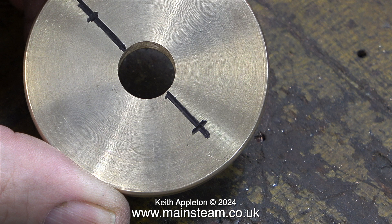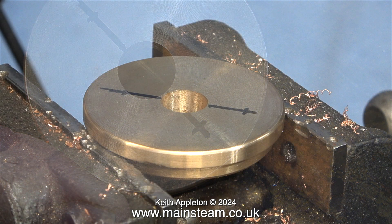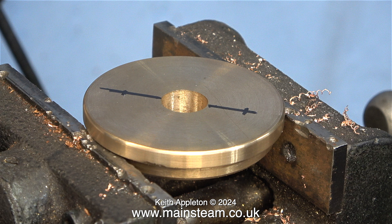I wiped it off and started again but it still wasn't good. There must be a simple way to find the center. I could make a brass plug that is a snug fit in the hole, turn it in the lathe and run a lathe tool across the end of it so it would have a line on it — and that really would be in the center. Or I could put the part straight into the lathe chuck and mark each side with a sharp lathe tool on center height.